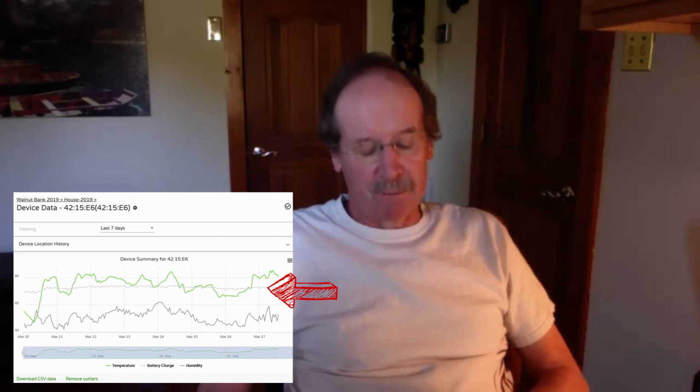I check in my Broodminder what the battery level looks like over time. It should be okay if you have replaced the battery in the fall, and it should be good to go for the summer, because now it gets warmer and the battery levels will recover. If they do not recover, then you have a device that potentially has high power consumption, and there is a section in the user manual that tells you what to do in case you have such a device.